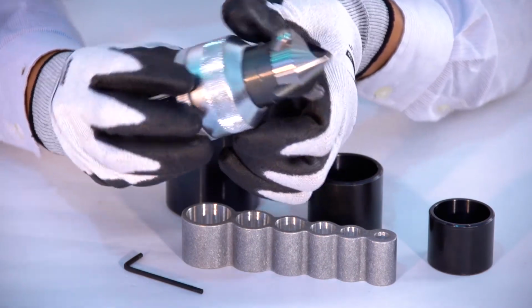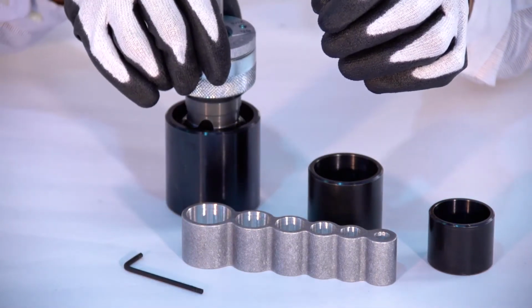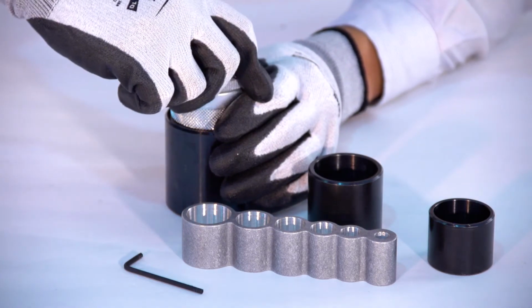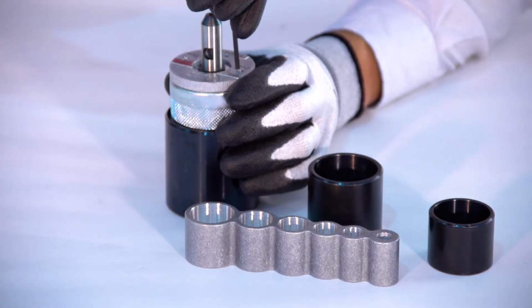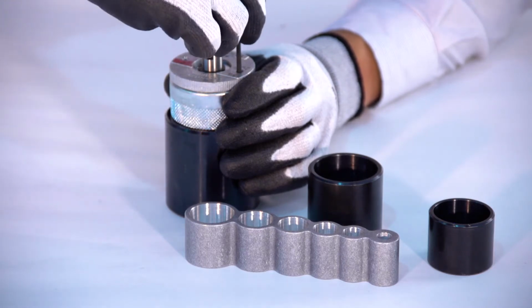Retract the forming pins about halfway. Now, place the T-drill head with the pins only partially extended into the appropriate gauge. Turn the base plate clockwise while holding the cone-shaped cover in a stationary position. At this point, the forming pins should be pressing tightly against the sides of the gauge, while keeping tension on both the base plate and the cone-shaped cover to eliminate any spring back.